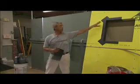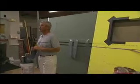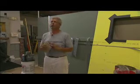The base of the wall as well. Normally, once they install the windows, you'd have a head flashing component, and then they would actually treat over the top of that again. In the past, when we first started utilizing these moisture drainage systems, we used a peel-and-stick membrane, which is still an option today.